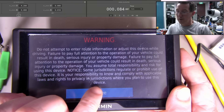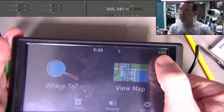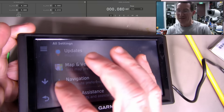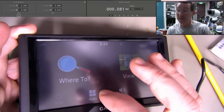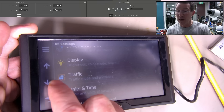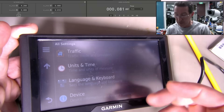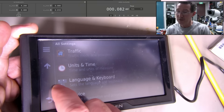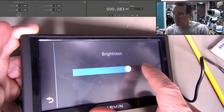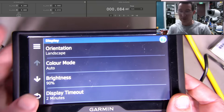I'll put this thing back together. It's showing a charging indicator up there but not showing any battery capacity — not sure if that's normal. The battery's obviously had it, but we were able to at least get it back out of under-voltage lockout and start accepting some sort of charge again. It might be no surprise if this thing just doesn't work when I disconnect the USB. Let me bump the brightness — it's at 20%, that's why it's not very bright. There we go, and it jumped up from 4 watts to 4.8 watts. Now we have a bright screen.